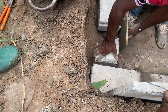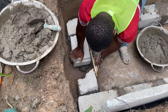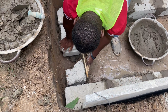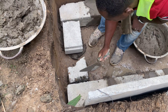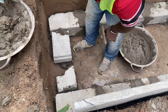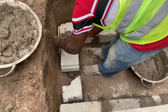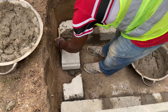These biodigesters are being put on the six-inch blocks — going down for the prefabricated slabs to be erected on them. We are putting the blocks flat so that it can be firm and will not move, will not shake, even if the final groundworks are done with grinding and all the activities that happen when homeowners are finally doing the groundworks for their building or compound.